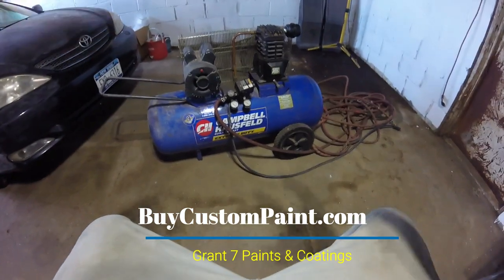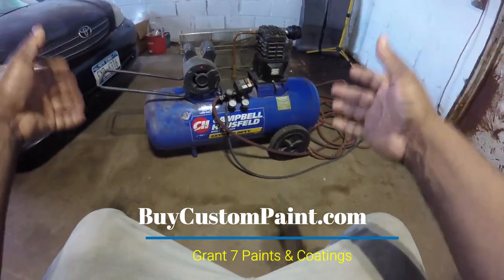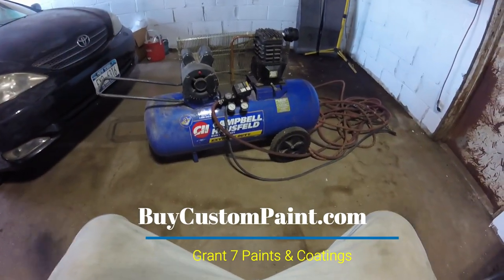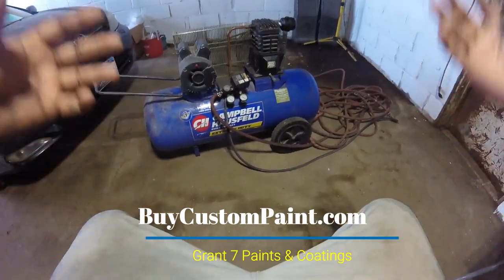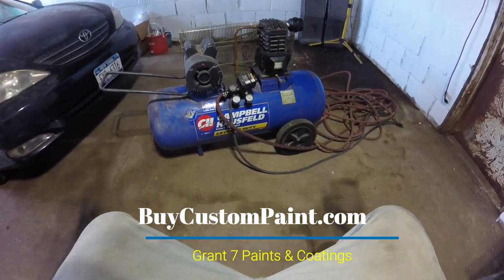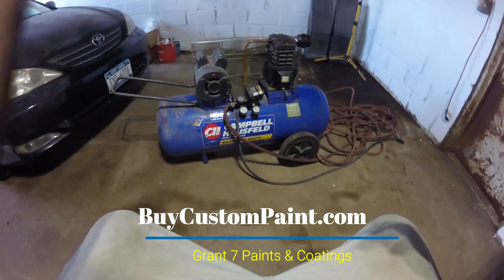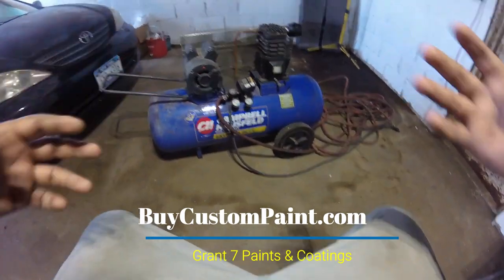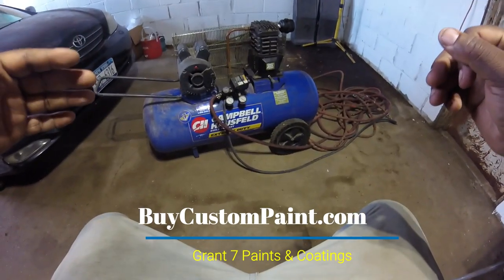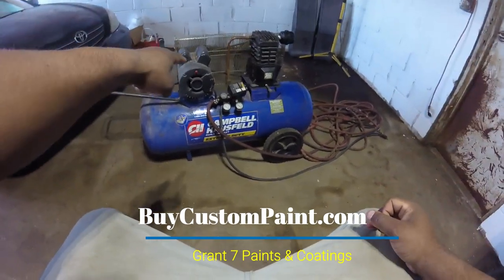That's how they got the five — this motor is capable of doing five horsepower, but not out of a 110 outlet. It's honestly putting out about two horsepower. These companies were all advertising at peak horsepower — it was like a conspiracy. If you look at home garage compressors online, 20 or 30 gallons, they're still going to say five or six horsepower. It's not the truth. Because these compressors are putting out maybe two or two-and-a-half horsepower, you do want to aim high — don't buy one that says two horsepower, because you may only be getting half.